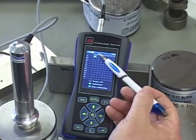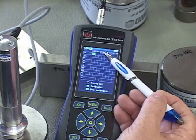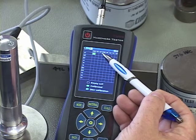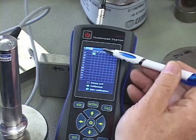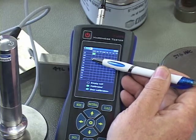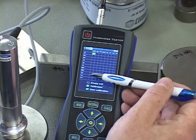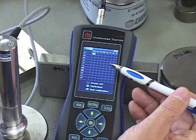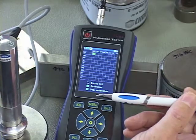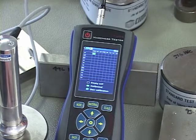Here we are in calibration, and right now it's showing we have one calibration for HRC. Next to it would be HB Brinell, then Vickers, and HRB — which is only used when we have the D-type test probe attached. Down here are different material types: alloy steel, stainless steel, cast iron, aluminum, and so on. The non-ferrous ones are ready for the D-type probe, which is different from the ultrasonic probe — this model can have that attached optionally. We're going to calibrate for steel because these blocks are steel blocks.